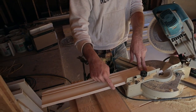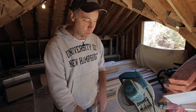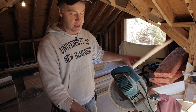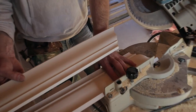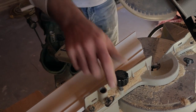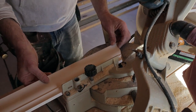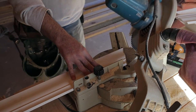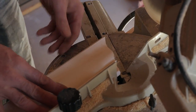I've placed the piece I just cut back on the miter box so you can see the orientation of the trim. This is the top of the molding — the back cut was going this way, setting us up for half of the outside miter. For the other side, I'm going to put the bottom towards the fence instead of the top, and rotate the table angle to 32 degrees in the other direction. What we just completed was an outside mitered cut.